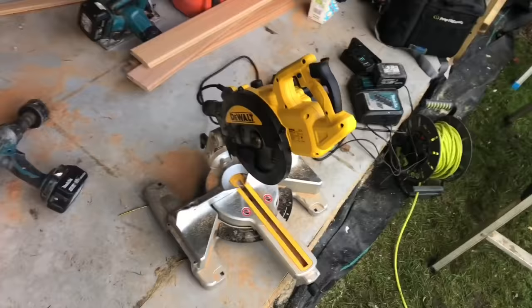Right, so what we're going to do, we're going to run the cedar round. Customer wanted it running vertically like that, so we're going to run it round. So obviously, we're going tongue that way, and we're nailing through the tongue so it's concealed. On the edge there, you can see I've nailed it, but the soffit's going to hang over that and that'll cover them. So this part, obviously, is running the wrong way. So what I've done there, I've planed that little bit there. So when I put that bit up to it, I've got a double bevel and a couple of end nails in there, I'll be right. And we're going to then put all them pieces on all the way down that soffit.